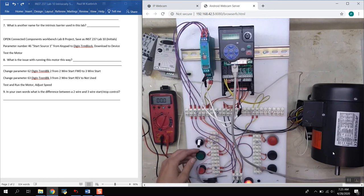Using normally closed for stop commands is very common. The last question asks you to describe in your own words the difference between two-wire and three-wire start-stop control. In the last lab with the PLC, the output came on and stayed on the entire time — it was latching in the PLC. Here we just have a momentary push button: the drive sees that momentary signal, then latches on its own until we push the stop push button. You should be able to turn this in on Blackboard — let me know if you have any questions.